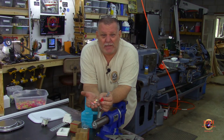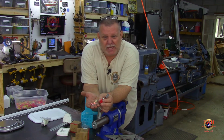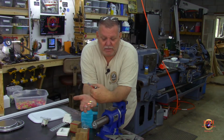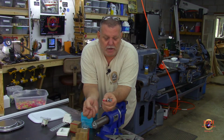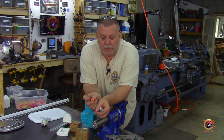So each one of them has 3 in it, because the way I did it, I usually wire my sockets up with just little pigtails so you don't have to hit both sides and then wire it up into the box. That's just the way I do it. But these things right here, you just cut your wire with 1/2-inch copper showing and push it in, and that's it. And they come in different sizes, so if you're only going to use 2 wires, like if you're just going to wire nut it together like that, if you got an outlet that you're running in series and you want to pigtail it, I pigtailed here and then one side of the wire and the other side of the wire.